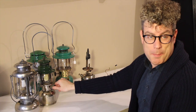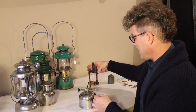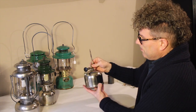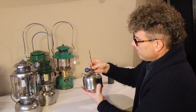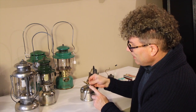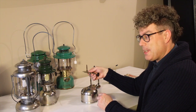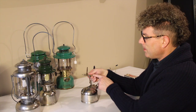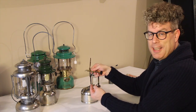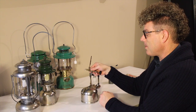But what happens now? This is where you open the valve, but what happens when you open the valve? Now we need to look at the guts — the stuff inside the lantern that you don't normally see. You've got the valve, which is normally hidden inside the collar. If we unscrew the valve, we'll see the fuel pickup. On a kerosene model — and the quick light is the same, as are the arrow lanterns and arc lanterns — it's just a tube, it's open-ended. If you watched the instant light video, you remember it had that fancy fuel-and-air tube within a tube with an air hole and an air wire that limits the amount of fuel. This has nothing like that.